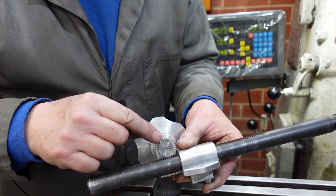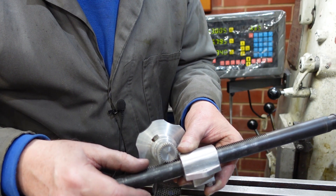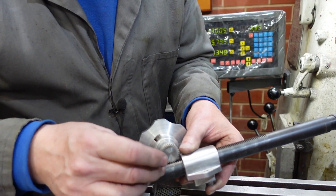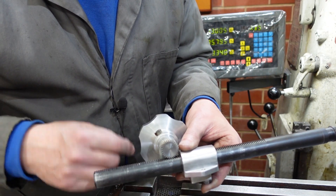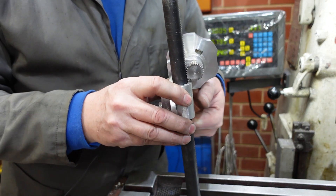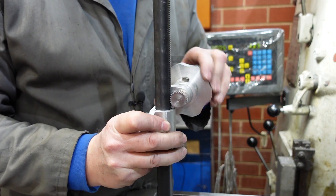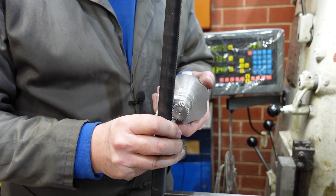Here's the end result. I've got the distance between the PCD of the gear and the pitch plane of the rack to what they theoretically should be, and it works quite nicely. The depth of the tooth is such that 0.2 to 0.3 of a millimeter is enough to make a difference. It does crank up and down — it's a little bit notchy, but I think that could just be the quality of the rack and the way it's suspended.